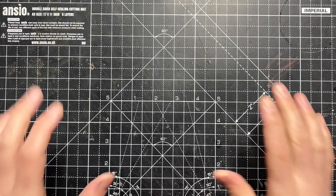Now I'm starting to put in the jawline of the horse — where it meets the neck — and I'm making what's called a stop cut. Looking at the angle I'm pointing the knife, I'm carving it into a V shape: pressing gently on one angle and then switching to the other side and pressing again. That's what's known as a stop cut — essentially we're carving a groove to define that shape. And I'm using the stop cut technique to carve the belly and the legs as well. A stop cut is a cut that prevents us carving past a certain point — we press the knife down into an area and then carve against it so the knife has something to butt against.